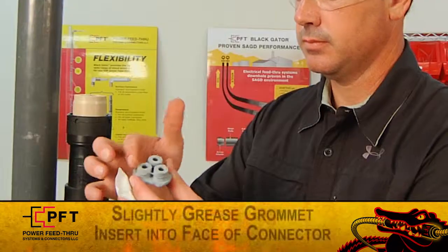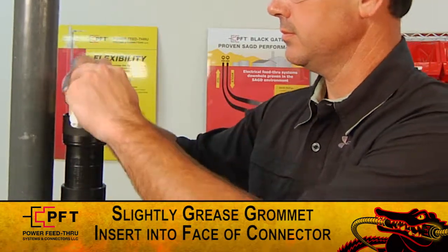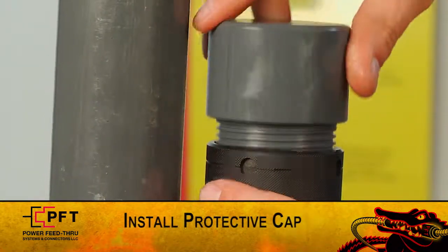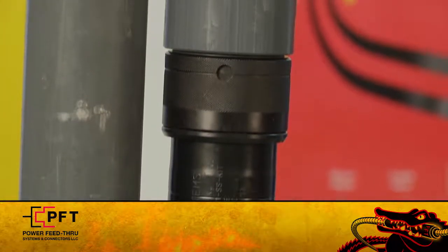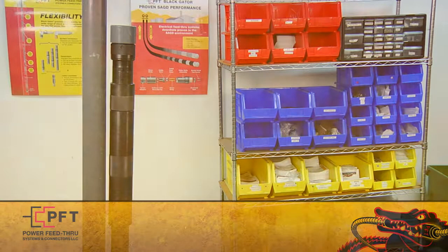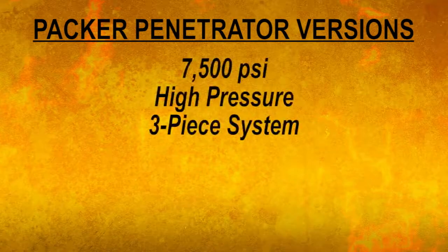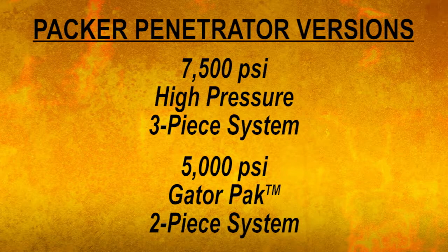Apply a small coat of grease onto the O-rings of the minor body. You can now slide the sleeve up and into the back of the minor body and engage the threads. Note, the minor body should be hand tightened and does not require any other tools. If it will not fully thread on, remove the minor body and inspect threads for damage. To finish, slightly grease the OD of each nose on the grommet and insert it into the face of the connector. Lastly, install a protective plastic cap.